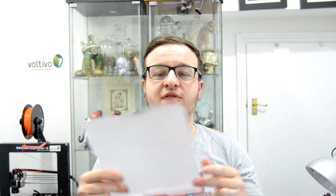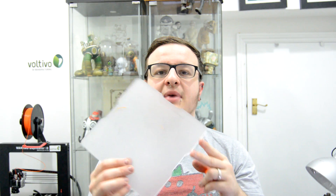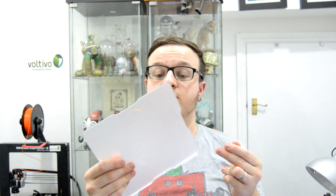After a few little tweaks I'm actually really happy with it — I'm not going to be printing on my regular build plate anymore. My machine still has the build tack applied, but this works great. With the rough texture on top, if I ever mess it up — as you can see my nozzle has run a bit close at some point — I can just get some sandpaper, sand it back down, give it a nice grippy texture again, and keep printing. It works great.